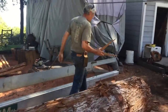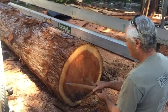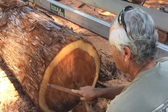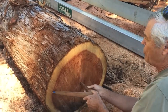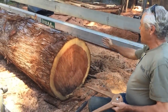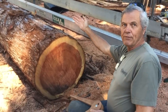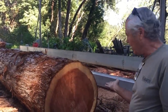Over on this side, the pith looks like it's right in the dead center — a little bit low. This is approximately the same diameter as the other end of the tree. When setting this up for a parallel cut, I want it to be offset further over on that side. I don't want the edge of the log to run parallel with the rail, because if I do, I'll get to the end and be real thick on one side and real thin on the other. I want to balance out the whole log.